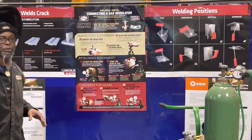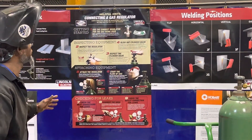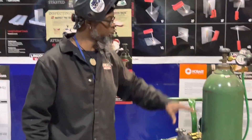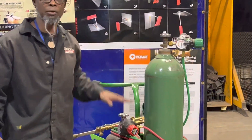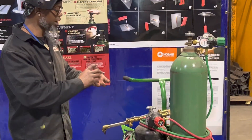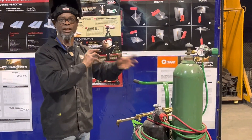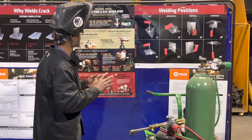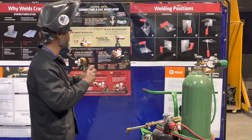And then I'm going to cut a piece for you and show you how to actually use it. The first thing you want to do is use the correct regulators for the gas being used. You don't want to put the gas on the oxygen and the oxygen on the gas. They do make them with different connections on the end — opposite screw-on or bolt-on — so it's harder to mix them up.